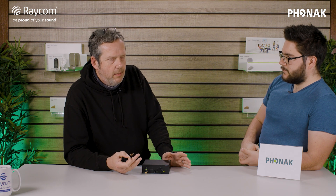Range has been a key point of the Roger system. The system works on 2.4 gigahertz, which is a fabulous frequency — it's digital, nice and clear and strong, and widely used. It's quite a large chunk of the spectrum, so the equipment uses a frequency hopping system to move between clear channels across the whole 2.4 gigahertz spectrum, and it's uniquely encoded. What 2.4 gigahertz doesn't particularly like is open space — it actually needs reflection to grow and strengthen the signal. Things like walls, metalwork, and other solid objects it really likes.